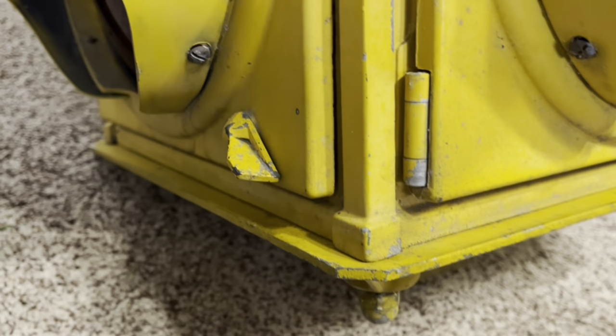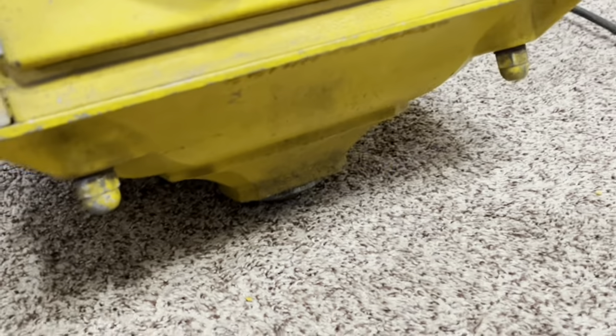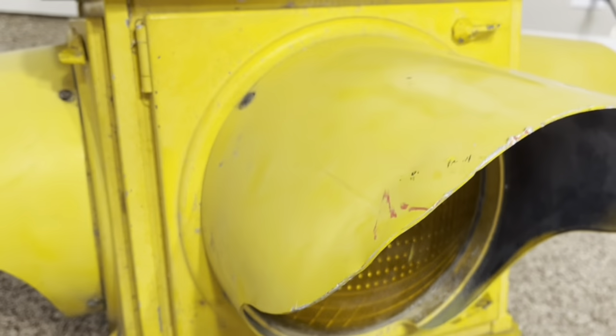On the bottom the overhang is much less. The bottom piece is almost the same as the top except it's not marked with the four directions. On one of these sides it says Crouse-Hinds on the bottom. The bottom piece is basically the same shape as the top but slightly different — it's got these ribs here, and it's designed to fit inside the section instead of over top. You can see those same acorn nuts where those rods stick through the signal.